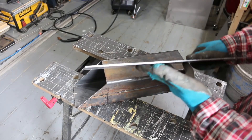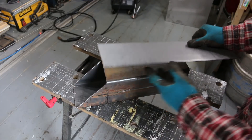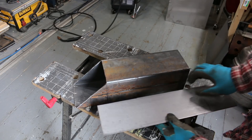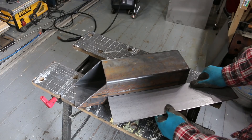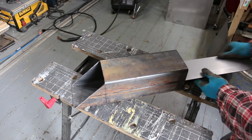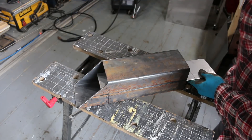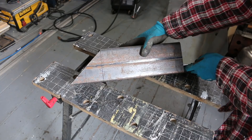What I have here now is a piece of one-eighth-inch steel plate, three and three-quarters inches wide so it fits on the inside. It's just over maybe 16 inches long, but I have to cut it. I'm going to put it inside and it'll fit to about here, one inch up from the bottom. The air can flow up through like that and burn, so I'm going to weld it about one inch up.